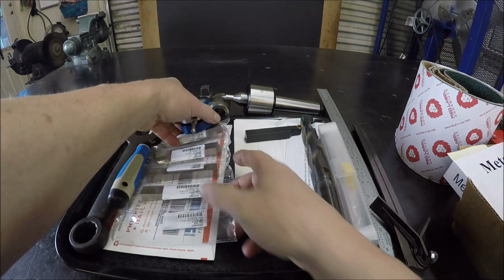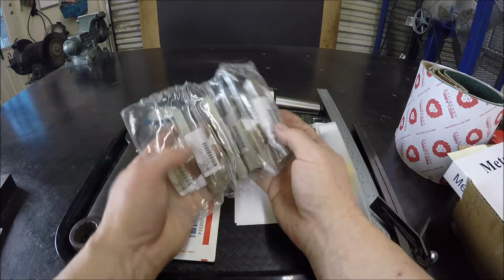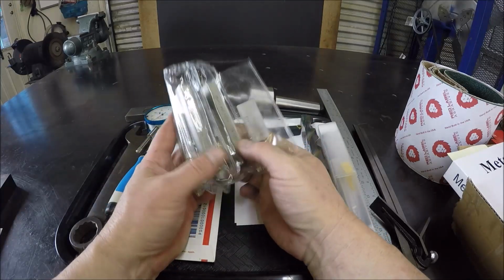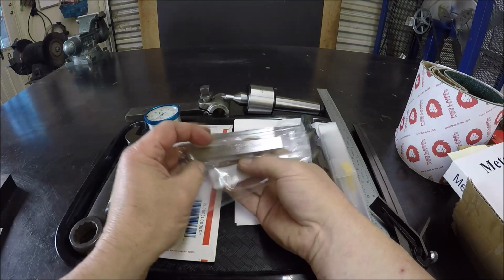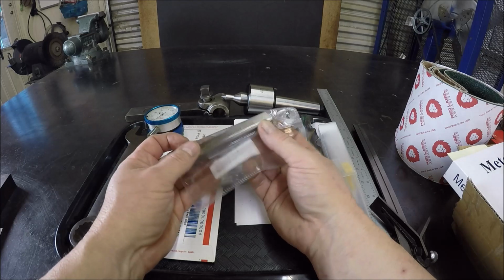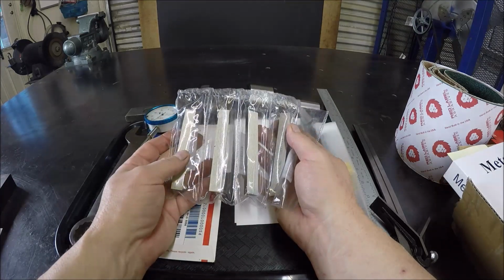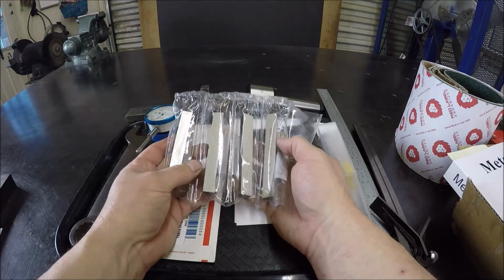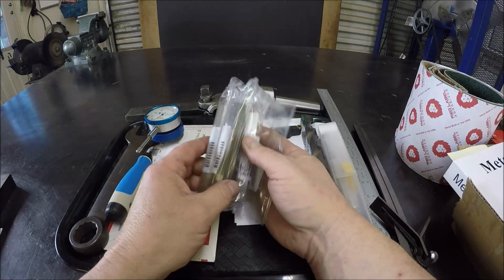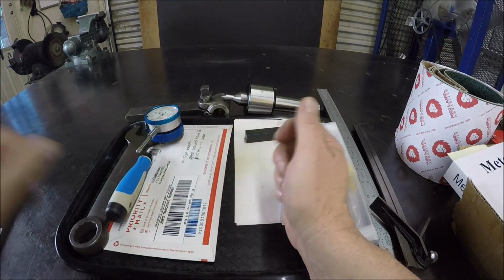And to be able to use the tooling that I got with the shaper, I picked up some more high-speed steel. I got this from All Industrial. They had the best price. Nothing special, this is just import high-speed steel, so not sure how the cutting edges are going to hold up. I couldn't find any good stuff on eBay, any Momax or Rex 95 in 1/2 inch by 1/2 inch. So we'll give this a shot. Hopefully we'll have some cool shaper action coming up.